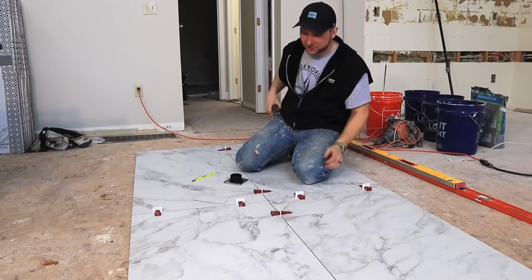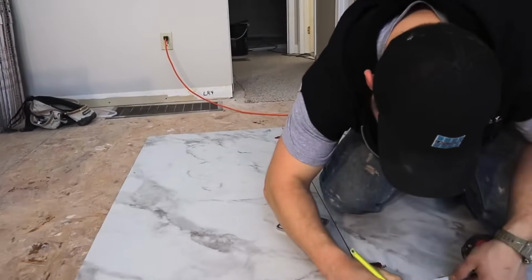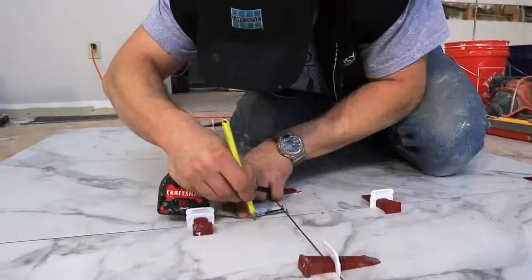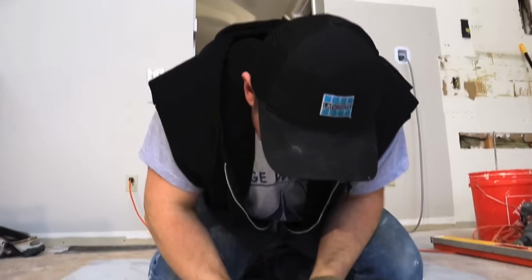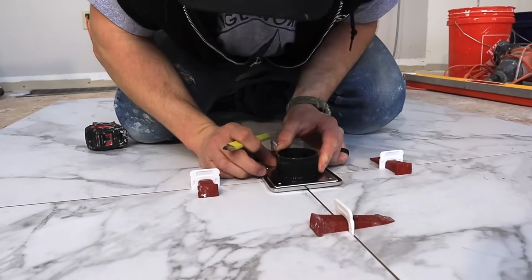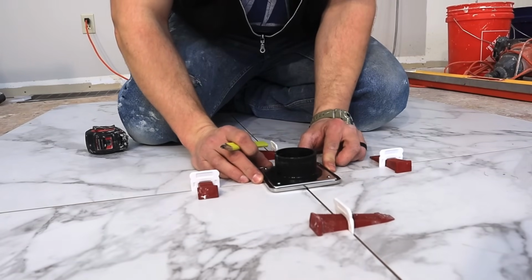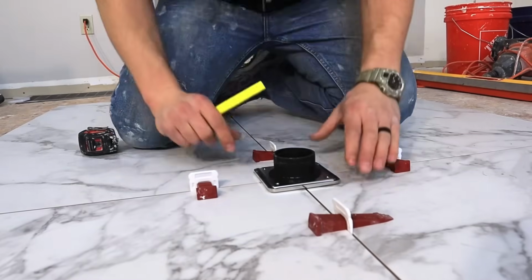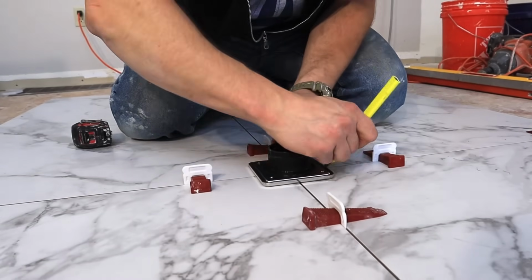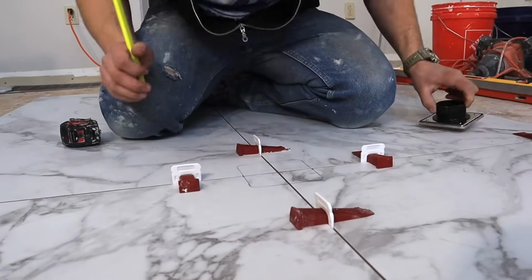So our drain is 4 inches. So come over here this way. We have 2 inches. This way. Now we have our drain. We're going to put it upside down, centered, kind of where we want it. Like there-ish. Then I'm going to make sure that it's nice, like that. Put the pressure on top. And we're just going to take our pencil. Bang. So that's our drain.